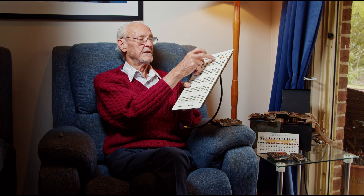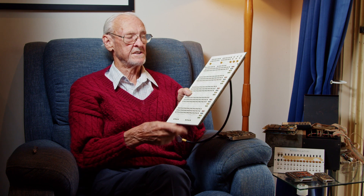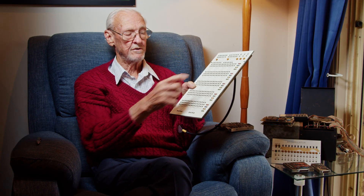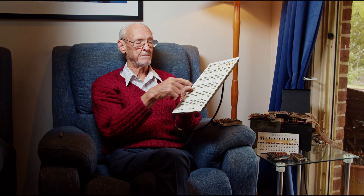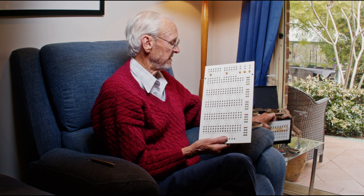There are a couple of JK flip-flops with all the inputs and outputs available, some monitor points for monitoring certain signals, and the rest of it is logic — OR-NOR logic — several four-input gates, mostly four-input and a couple of larger eight-input gates at the bottom. Those could be plugged via taper pin connections, and small leads could be used to interconnect those with the registers which were at the top section of the computer.